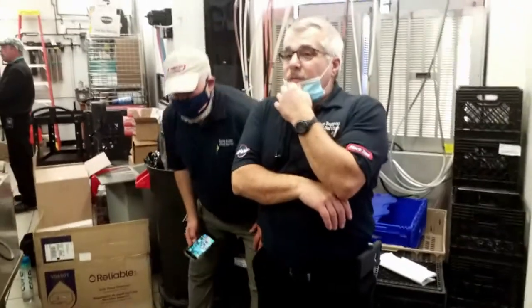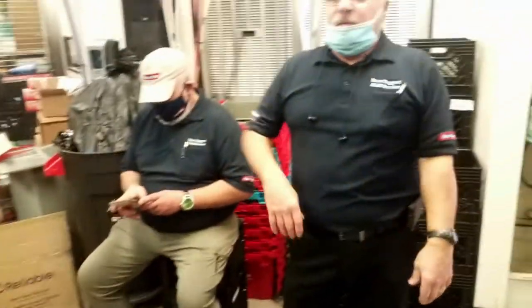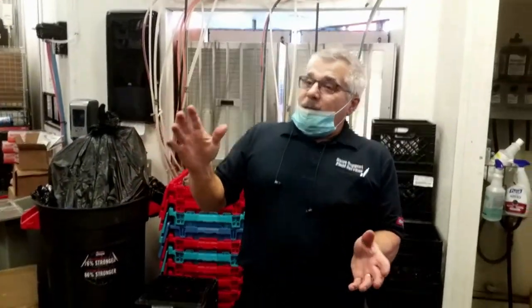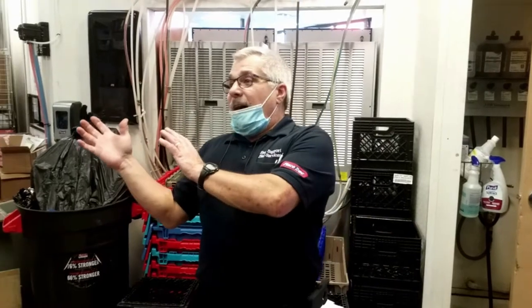I'm sure you guys have all worked on FCB machines, on the Vipers. And you're going to fill them, and you're filling it, and all of a sudden it's beeping at you, syrup out. What the hell is syrup out? There's plenty, and then all of a sudden it kicks back in. So the reason for that is there's too much variance in the pressure switch on the air compressor. So it runs out of pressure before it comes back on. I always set the pressure up higher.